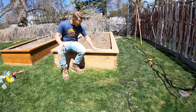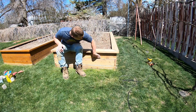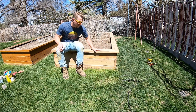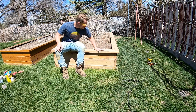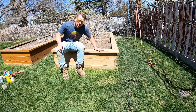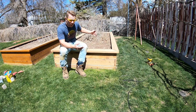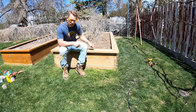Now is a great time to see where you've missed with sanding. I actually see I want to go a little bit further here on this surface because this gets the most sun and will actually damage the quickest. The tops of these boards are in the worst shape because they get the most sun exposure. If you look at the back half of the flower bed, that wood looks untouched on the backside — because it's not water or shade that's hard on wood, it is direct sunlight that will chew it to pieces every single time.